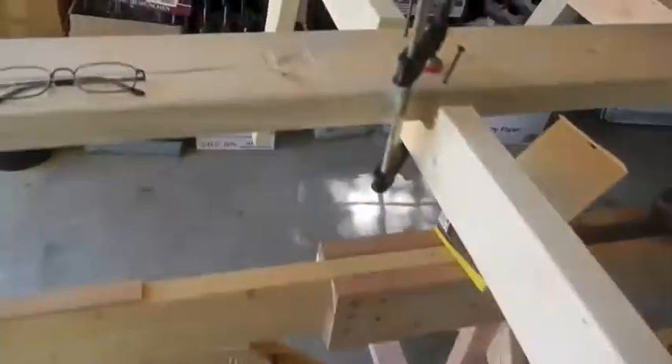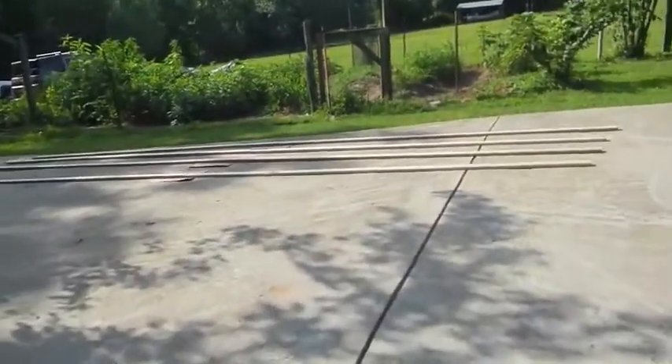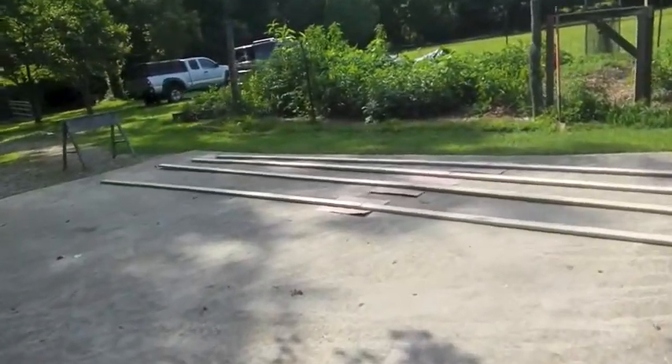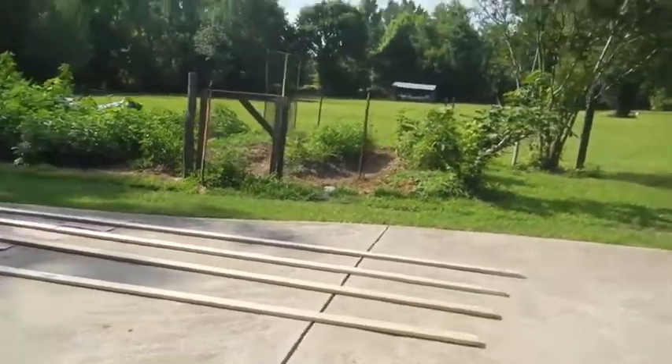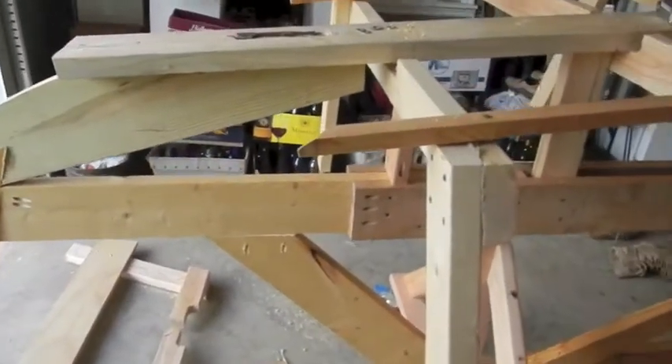A little update on the day — it's really going to be end of day three. Not bad, I'm pretty happy actually. Got my scarves done on my longitudinal shear and chine. Got the bow section shaped how I wanted it and all glued in and lagged.